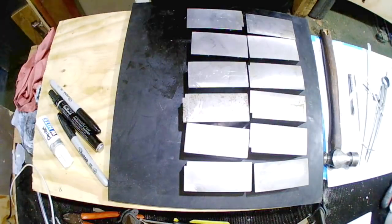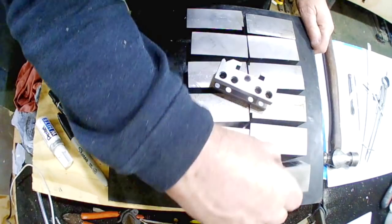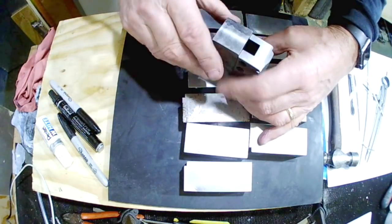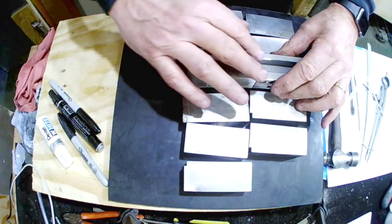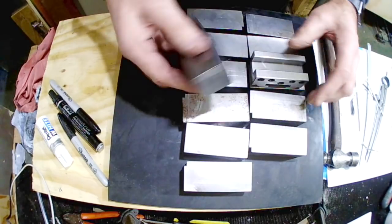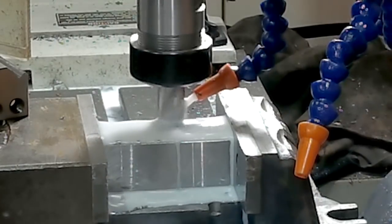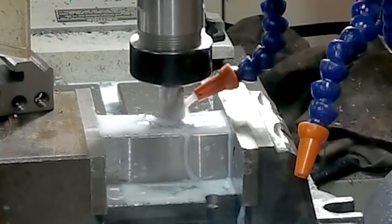To start with I had some bar ends given to me a while ago and decided to use this material for making some tool holders. I milled the material all round to pretty near the size of the existing tool holders. After milling them all to the right length plus a couple of thou for final finishing, I got on with roughing out both major slots, starting with the keyway slot first.